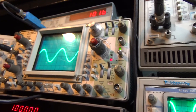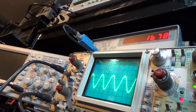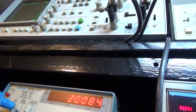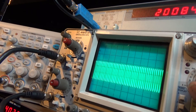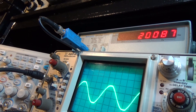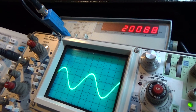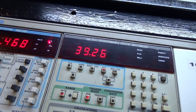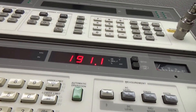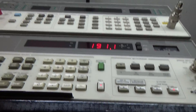Let's go to 20 kilohertz. Right around there — nice clean sine wave. Voltage, and distortion is 0.4%. That's 191 watts.